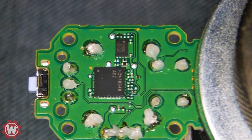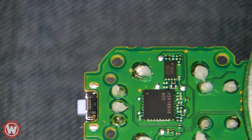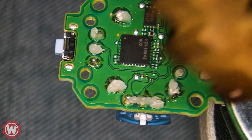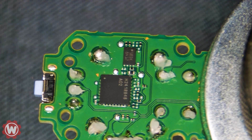This board has a chip in it so you've got to be extremely careful, but this works for PS5s, Xboxes, and I think there's some model for other controllers. We're gonna use a soldering iron — excuse me if you can't see perfectly what's going on — but basically this tool aligns exactly with the holes and the solder pins. I'm just gonna apply it like this and then pull it from the bottom and it should come out very easily.